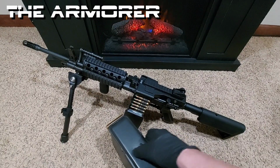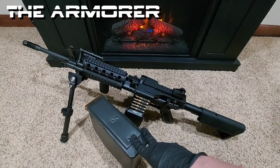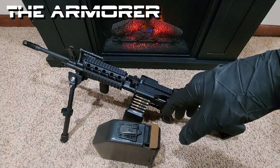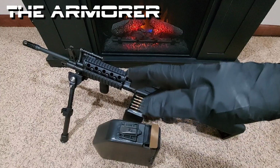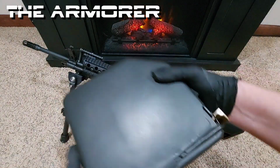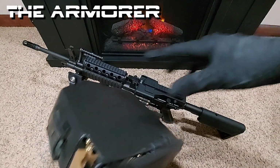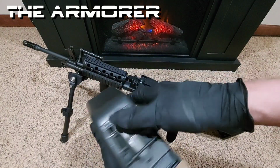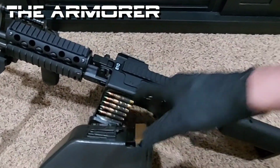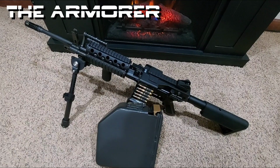Just a quick little rundown and overview of how I made this thing. To caveat on how I attached that bottom bracket, just four pop rivets. Okay, combine the two, epoxy resin, and pretty thick reinforced tape on both sides. Sanded it all smooth, and there's probably no exaggeration, like 12 to 15 coats of paint over the epoxy primer and whatnot, to get all the imperfections, at least as many as I could, off of there. But it looks like a production unit, except for like that door cover. But I'm sure if someone were to make something like this, they would definitely sell. But that's kind of the 350 round ammo box for the Fightlite MCR and M249 saw.